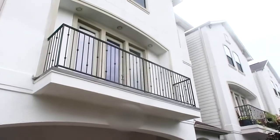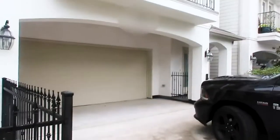I thought it might have been going inside, but there must be a good enough slope to that door where it's not damaging the floor on the inside. Let me go underneath and show you exactly where it's leaking. So I just learned my lesson — that balcony door was locked, so I had to jump from this balcony all the way down. We're keeping that on the YouTube channel only. On the outside, that crack came from the previous leak to this balcony — it was leaking down, caused the stucco to bulge out, and got a crack in this location. But there are no signs of water intrusion anywhere right now. So you want to make sure you have a really good infrared camera if you're getting into stucco inspections, because I would not have caught that without it today.